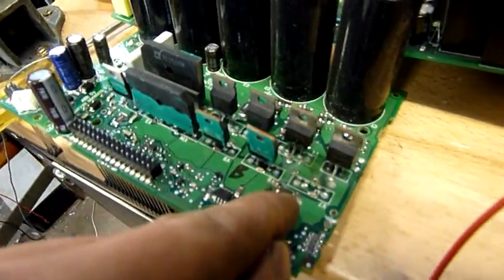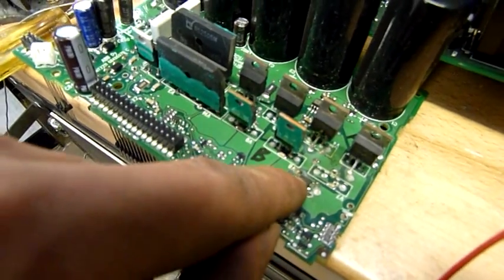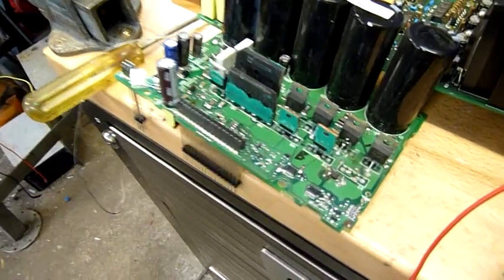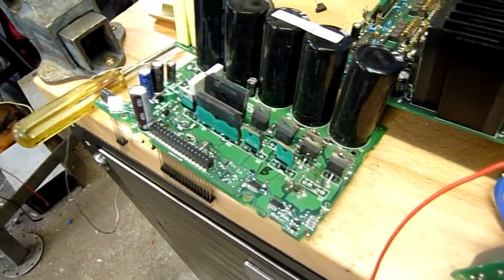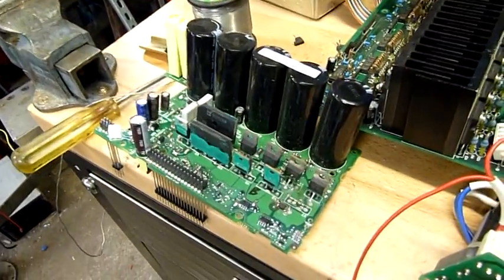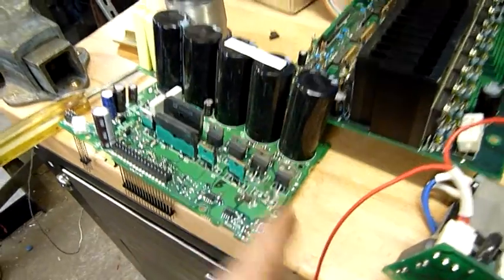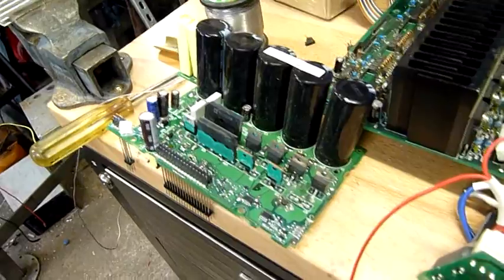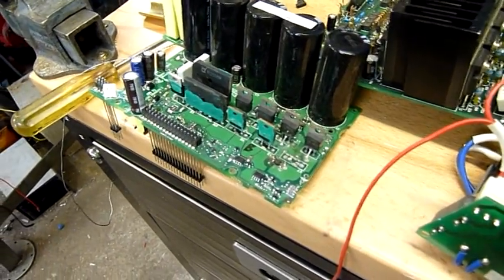I'm hoping if I remove that, there won't be any other shorts — the other ones look quite fine. That little surface mount device there, it looks like it had been arcing off that pin to the heatsink. I'm guessing something got in there and caused a short circuit condition, caused that arc — probably a spider or something like that. I'm going to meter the board after removing the second dead one, and if everything looks alright, I'll go ahead and get a couple of replacements and just chuck them in and see what happens. It's worth a try.